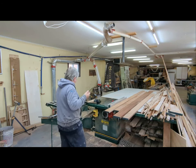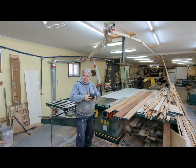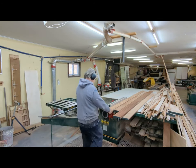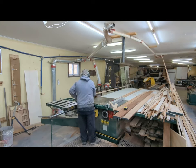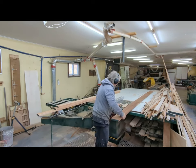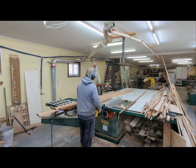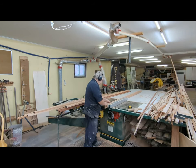All right, let's do it — let's not chop off our hands! The big thing with resawing like this on the table saw is you do get straighter cuts and you can go faster. With a bandsaw, resawing requires a lot of power, and I didn't really invest in that. So be careful when you buy one for resawing. The only real thing I'd stress is using a little push block — just keep your hands away and you won't have an issue.